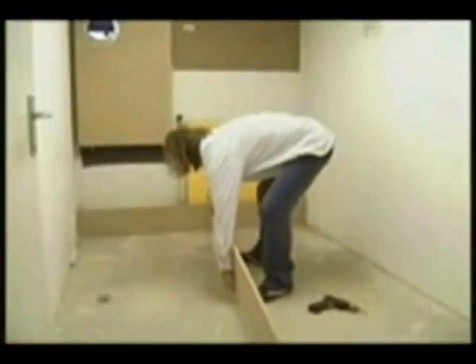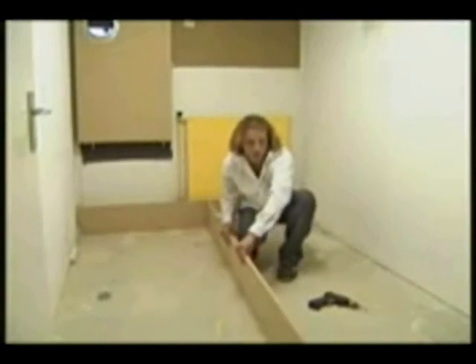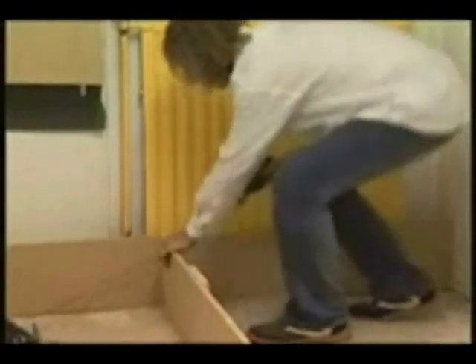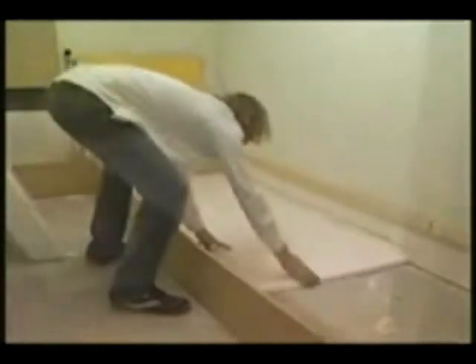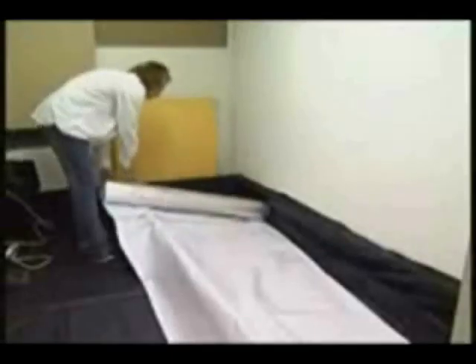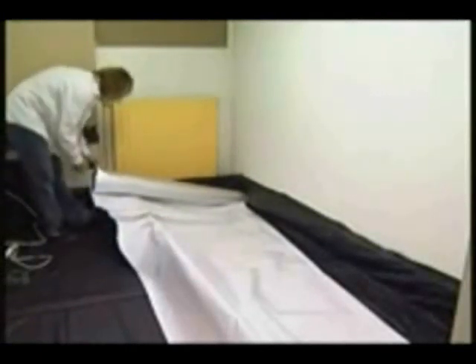To avoid leakage, we create a shallow basin to put the plants in. On the floor, we create an approximately 30 centimeter high rim. Polystyrene plates are laid on the bottom to avoid the plants coming into contact with the colder ground. After this, we cover the basin with PVC foil. The foil is only stapled to the top of the rim. The next step is to cover the walls and ceiling with PVC foil.